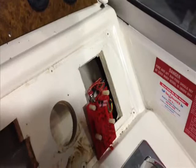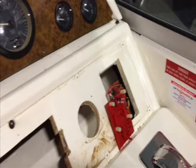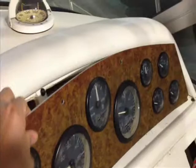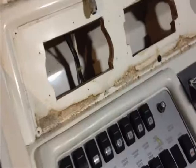We're in the process of having a new panel engraved for this area so that the Sea Ray monitoring system, which is right there, can get remounted and have the engraving to go along with that so we know what the LEDs are saying. What we're going to be working on now is removing all of the gauges in the upper panel because we're replacing the fascia so this will match with the new fascia where the electronics are going. That's a time-consuming part of the project because there's a fair amount of wires on the backside, and every single one of those wires has to come off, then all the gauges get removed, a new fascia cut, and then everything put back together.